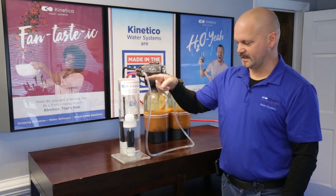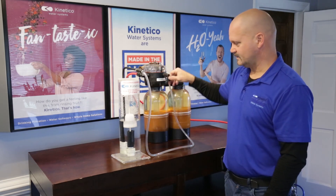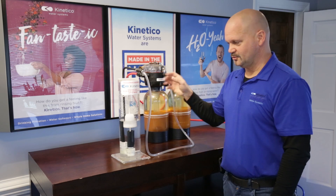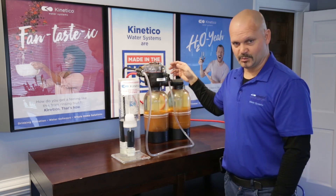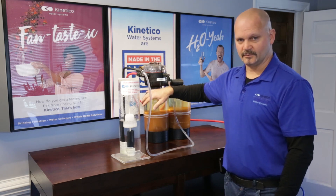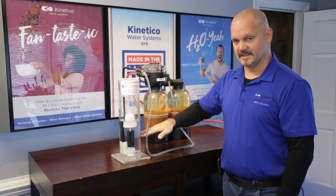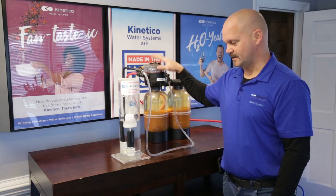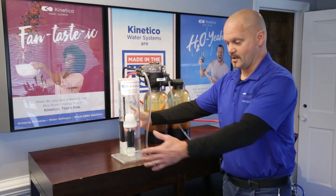There's a tube that connects this liquid to your unit. This tube can do two purposes: it can actually pull out saltwater brine and it is used for the cleaning process during a water softener's regeneration. But then once it pulls it out, it needs to put it back. So at the end of that cycle, the unit will actually push water back into the brine drum.